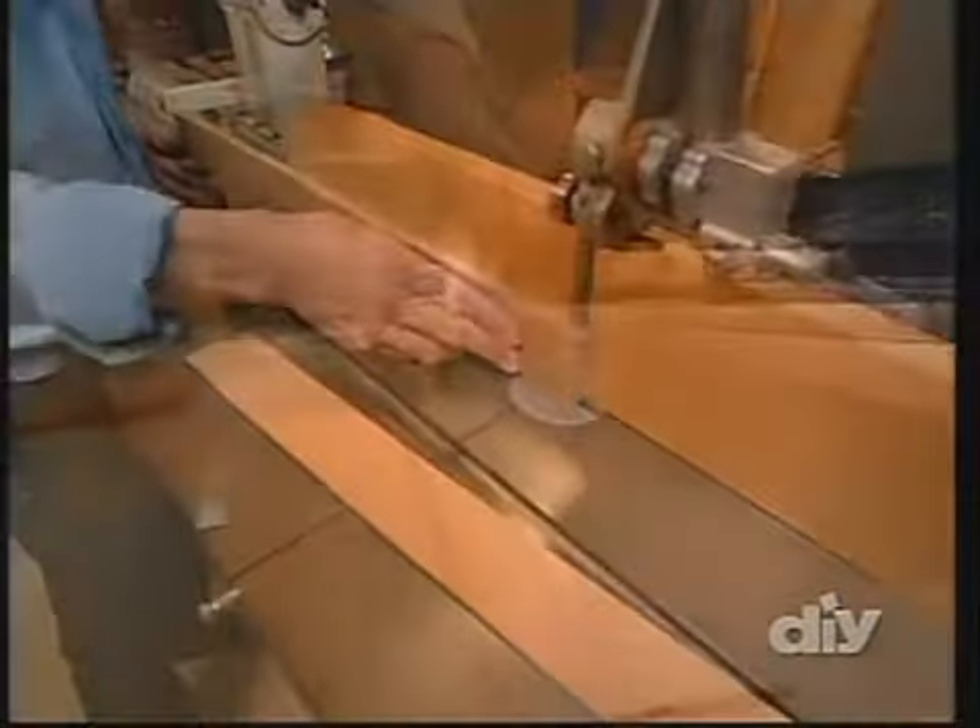We're getting ready to do the joinery on our legs using mortise and tenon construction. On the rails and aprons we're going to use a concealed tenon, so the mortises in the leg stock won't go all the way through. Down where the stretcher goes, we'll use a through tenon — the mortise goes all the way through front and back, showing on both sides of the nightstand as a nice decorative touch. To cut all our joinery, we'll use a multi-router, which has the router mounted horizontally with attachments to easily control the length, width, and depth of our mortises. Now all set up, we'll go ahead and cut our through mortises in the legs.